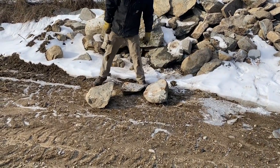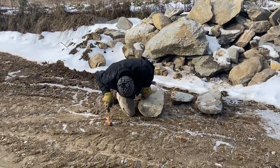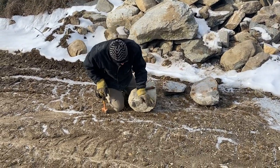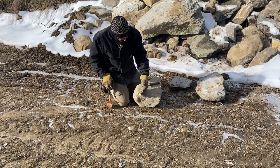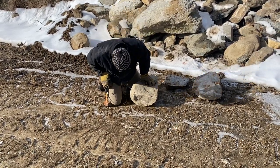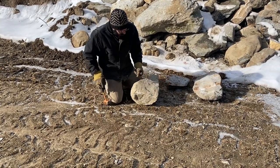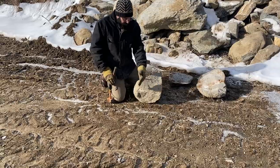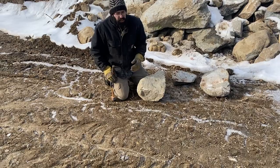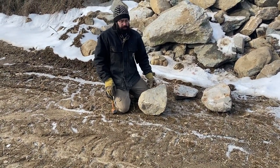A final stone to try — something that came down in a glacier and ended up here. You can tell it's been tumbled, but you can still see the striations; it tells us it's got a grain going this way, and again that's how I'm going to be splitting it. With this chisel, on some types of rock you'll find splitting from the side works really well, and splitting from the end doesn't work as well. With other types of rock it's the opposite and you really focus on splitting from the end rather than the side.